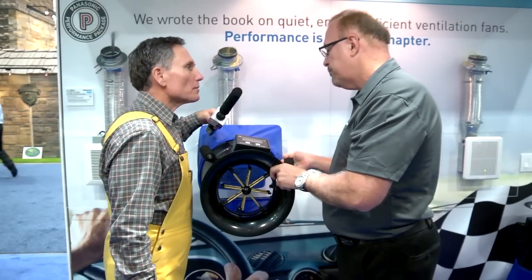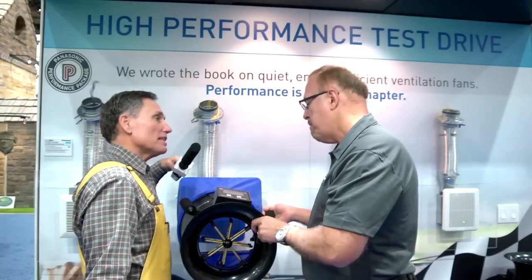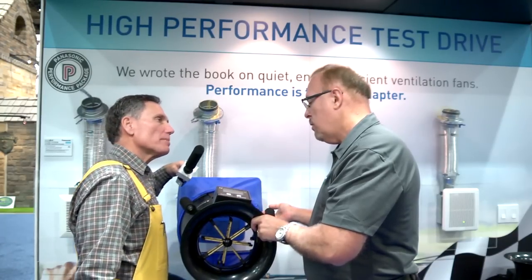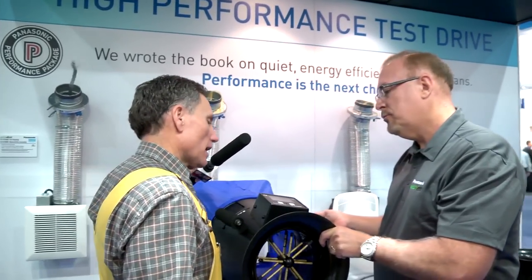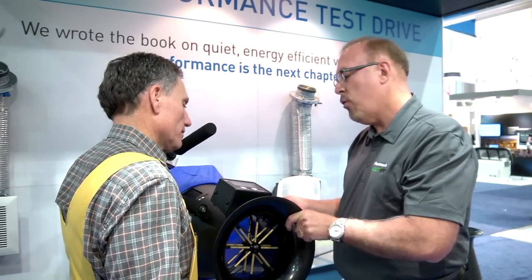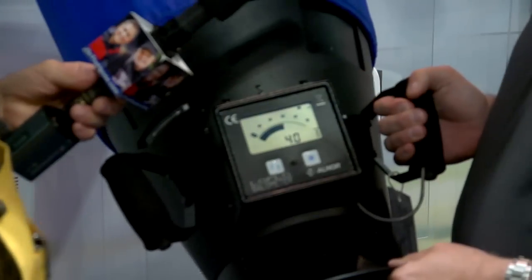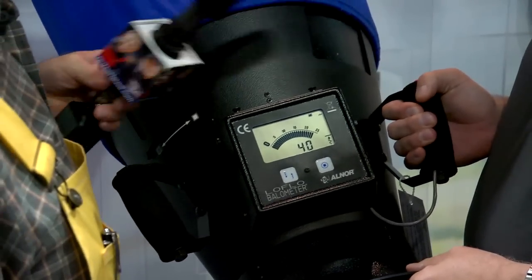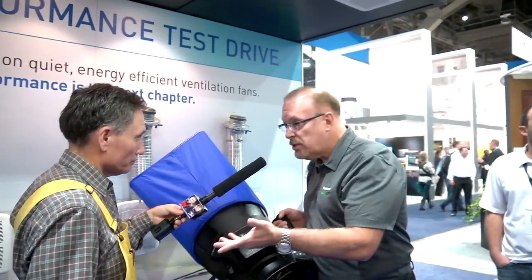We got it nice and tight. I'm a nervous wreck, Jim. Let's see how you did. I mean, that was a fair guess. 40. That would be my minimum expectations as a builder or as a consumer. So where are we at? I'm not happy, Jim. We're at 39. We got up to 40, so we'll lock that in. Wow. So we have 40 CFMs. Now, what did I say you needed to hit to qualify as a bath fan? 50 CFM minimum. So this fan would not qualify and would be red tagged. On the Game Show Network, we'd give it a buzzer.